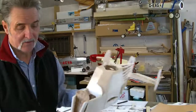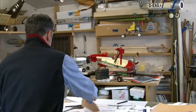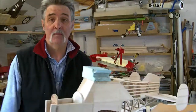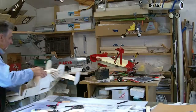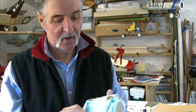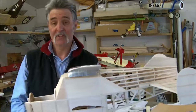I've got the block for the cowl - she sits up there like that, to be carved a little bit. The top plate will go on there of course with four nylon bolts holding the entire assembly. I'll be making the top out of a block of blue foam carved to shape - virtually the same as on the other model there. That's blue foam with two layers of half-ounce cloth epoxied onto there. I reckon magnets again - four magnets on top of the assembly. Easy.